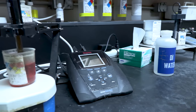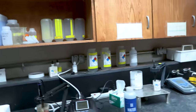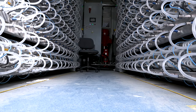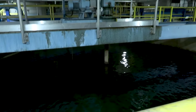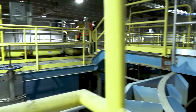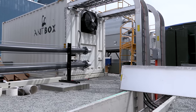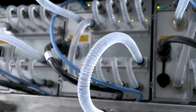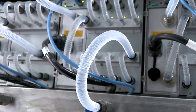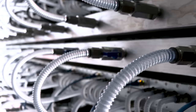This is just a sliver of what they used to monitor here — previously tracking chemicals like phosphorus, acid, ammonia, and urea. You're probably wondering about the level of detail around water purity for these hydro units. The reason is that Bitmain has encountered lessons learned in deploying these units at scale — mineral issues and scaling problems. Anytime you're dealing with water and finite tubing like these hydro units have, you need to maintain water purity, perform system flushes, and account for scaling internally.